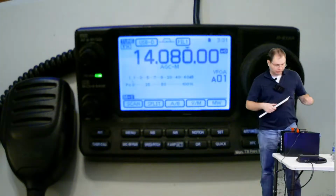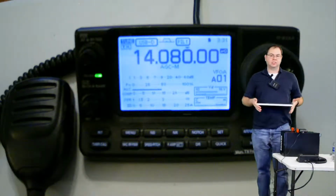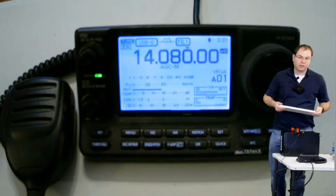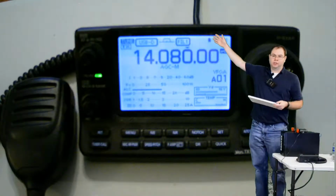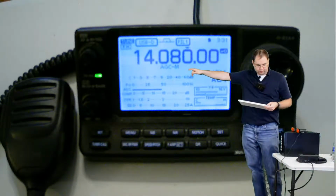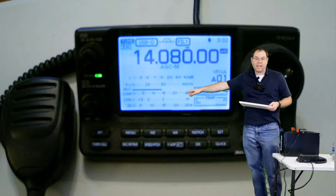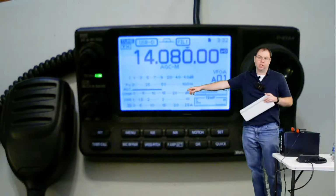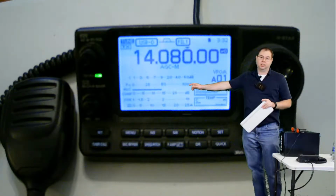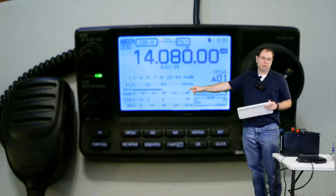Also let me go over a little bit here. If I go into the full display, this is the ICOM 7100 and the different bars here. The very first bar, of course, is the frequency, and then the first bar is going to show the signal strength received. Next is the power output, how many watts output. The ALC, what it's doing. You don't want it to be off the scale, clipping. On this particular radio, it does read a non-zero value anytime it's got audio coming in, but for mine, that's normal.